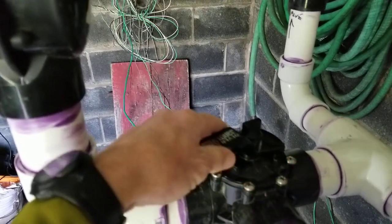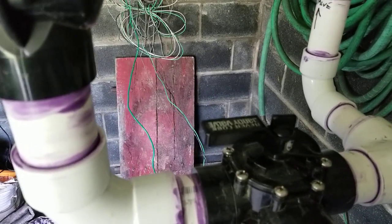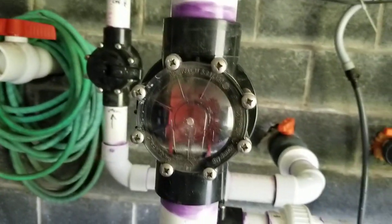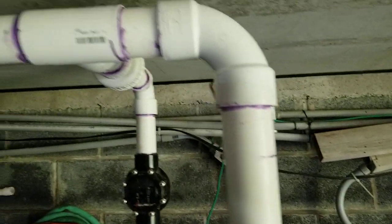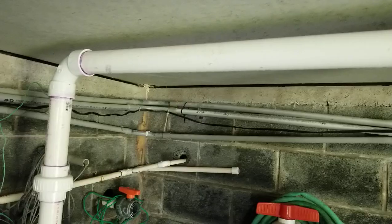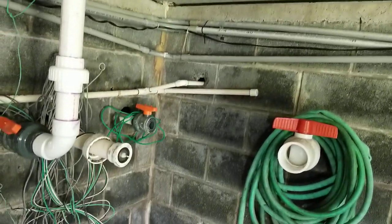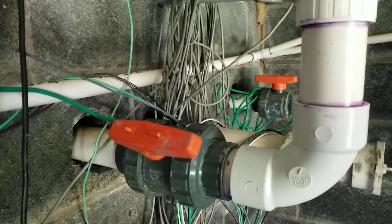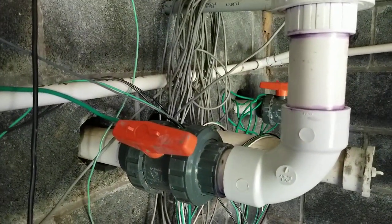When I come this way, I am 100% to the hot tub. And as I travel to the hot tub, I have another check valve on that line. It goes up, over, gives me a little head clearance there so I can get stuff underneath. Elbow, and then another valve. And it goes underground underneath my pool deck over to the hot tub.